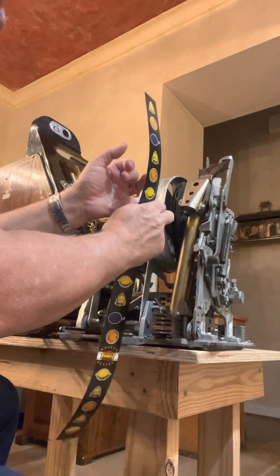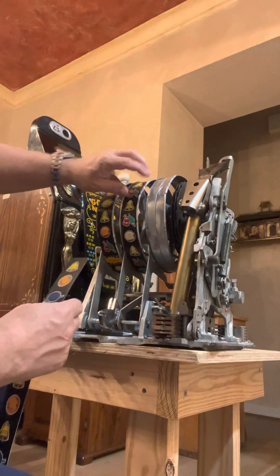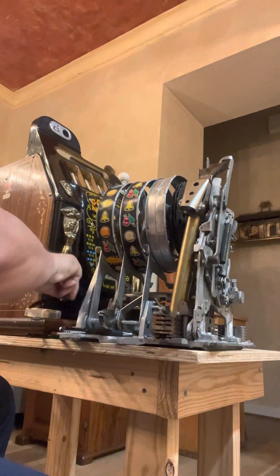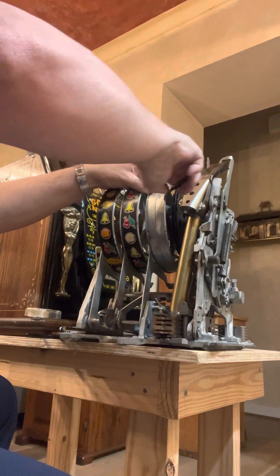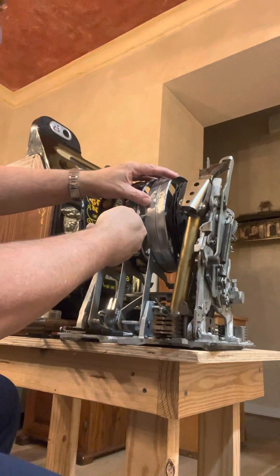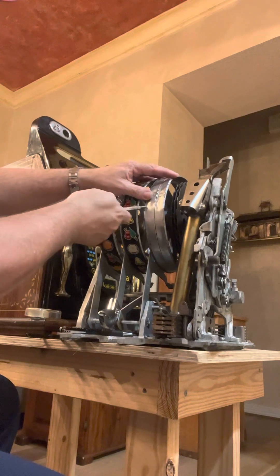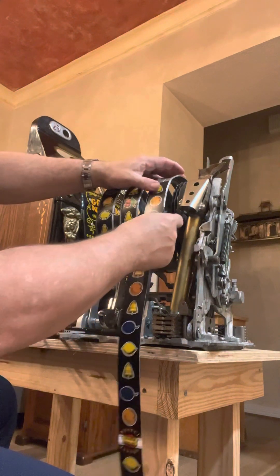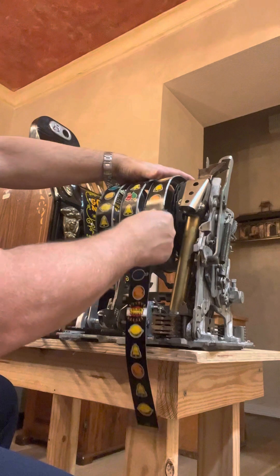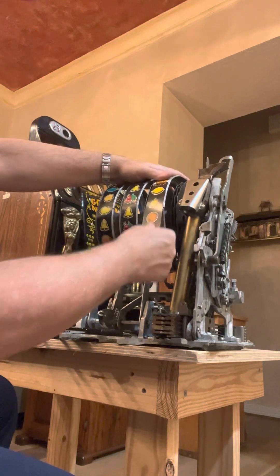We've got our tape here again and it keeps wanting to come undone in the back. There's also a notch that's in there. Because I don't want to bend the reel strip, I'm going to go ahead and open this up right here at the notch. That should allow me to go in with the bell and be able to push it along the whole way. Let it go on up — it starts to get a little snug, I'll push with my thumb again, and it ought to be coming around here pretty quick.